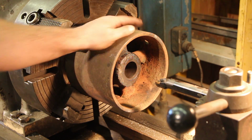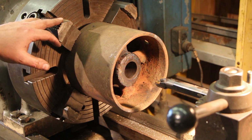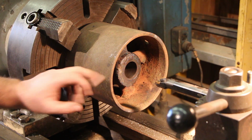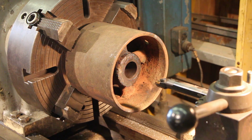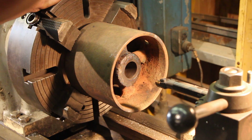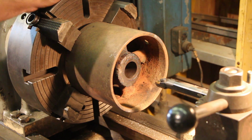We've got this set up in the lathe. This is a fairly small pulley, so I got it running true in the 4-jaw chuck using an indicator. We indicated on a couple different places on the face here to make sure that it was running true, and it's within 1/1000th of an inch right now, which is more than adequate for what we're going to be using it for. So right now we just need to bore it out just a little bit oversized. To do that, we'll just use a boring bar on the lathe here. So I will let y'all watch that.